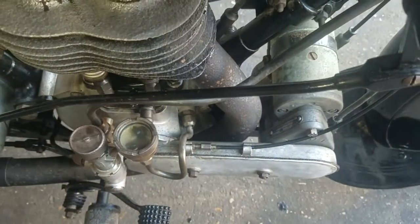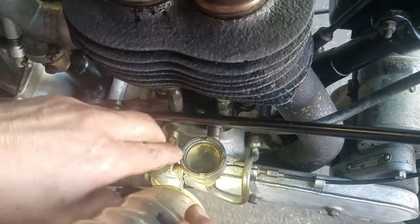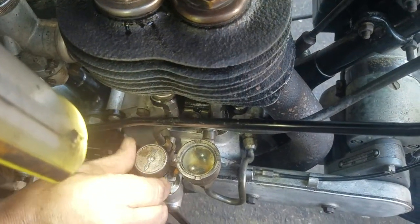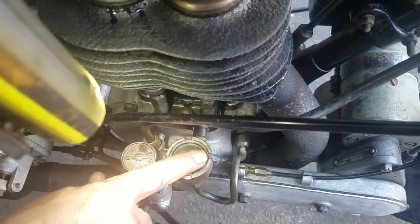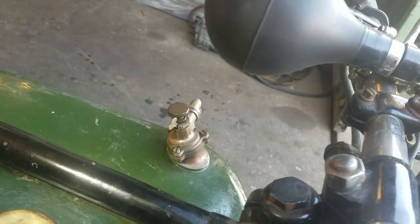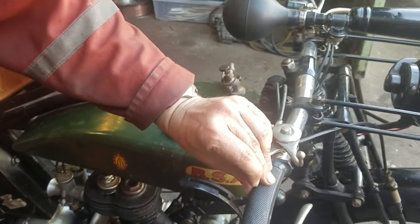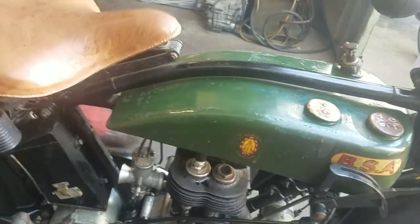You can just be able to see — you can see there's oil in there, and you'll be able to see it coming out of the little spout. This is the regulator: that's more oil in, and that's shutting it down. Another pump — if you want to give it more oil instantly, just knock that catch off and that'll feed it more into the crankcase.